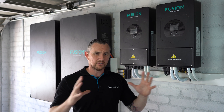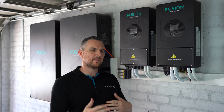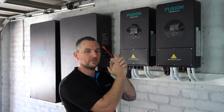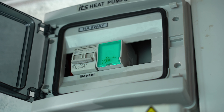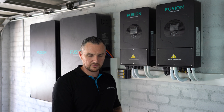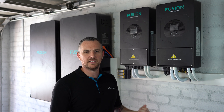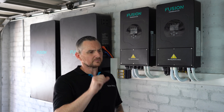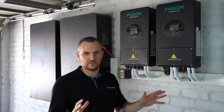This system works with an app called SolarMan, which is very good software available as a mobile app and also a desktop version. I prefer the desktop version as there's a lot of data to consume and understand. Run your system for a while, monitor it, see what's coming on and off, and try a few things. I also can't suggest enough getting Wi-Fi timers — also called Wi-Fi switches. They fit into the DB board or connect through your appliance's cable, which is great for turning on and automating your usage throughout the day.